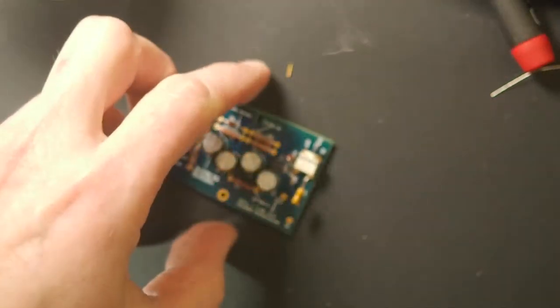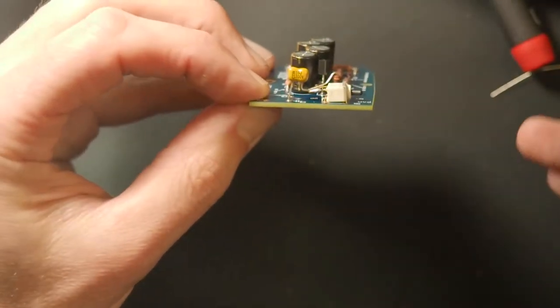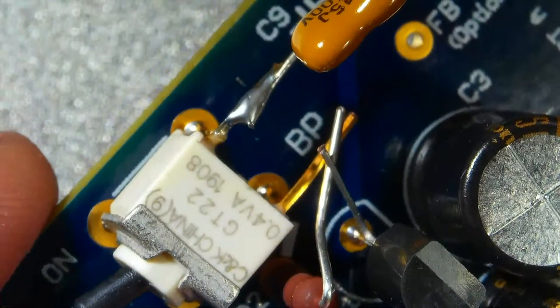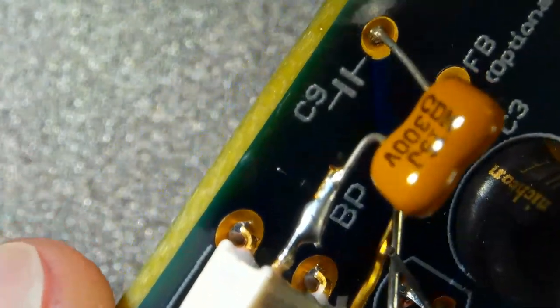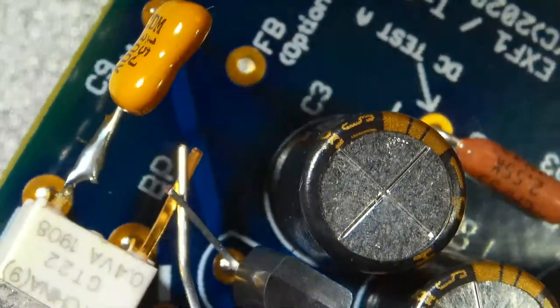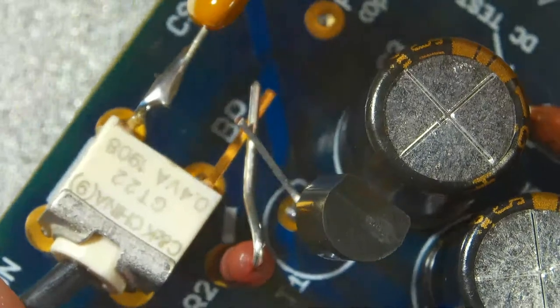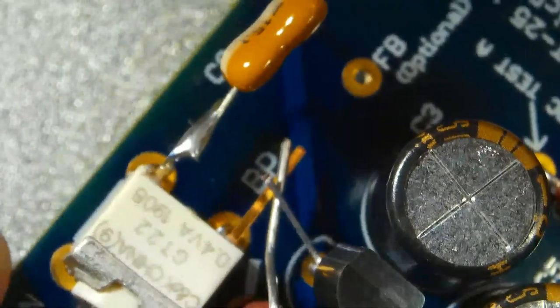Okay, I think I got it. It's a little awkward. Yeah, let's take a look here. Look at that. Okay, so not a ton of solder. For sure, not too much. Now we left this joint open. See those three leads there in the middle? The 1 gig resistor, the JFET gate, and the switch pin. We're going to solder those later when the capsule wire is available.